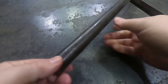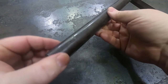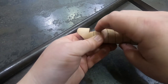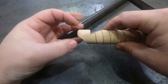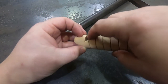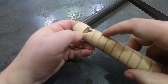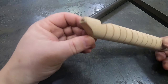So I want to make it out of this one-inch cold roll tube that I happen to have, with fairly thick 3/16-inch walls. Looking at how the standard design is made, I can't replicate that cut very easily in metal. So what I'm thinking is I'll make that beveled cut and then have another sleeve that comes over on top so I can get that aperture the way it needs to be. There's also this plug that goes in there — from what I was reading, that's the important part: all the air is channeled up at the top so it's just blowing right over this cut edge. That's what I'm going to try and replicate as the first experiment.